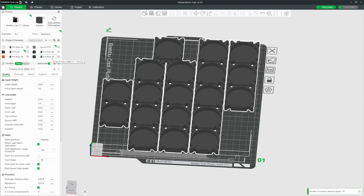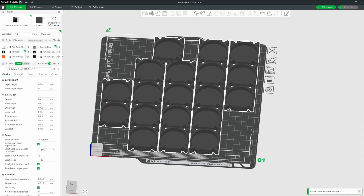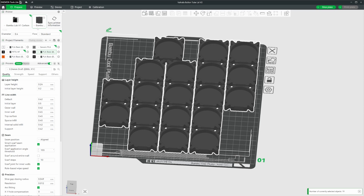If I was using the Frostbite plate, I would select all the parts I'm printing — you don't want to select just one because they'll have different filament properties — so we do Control-A to select them all, then go to Custom and Frostbite. That's controlled alongside our build plate selection, making sure Cool Plate SuperTac is selected. You can't create your own build plate, so we're piggybacking off these default settings and adjusting for the Cryo Grip build plates.